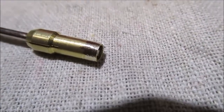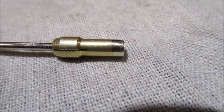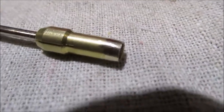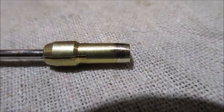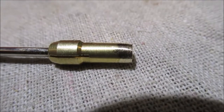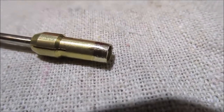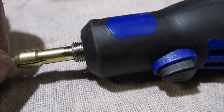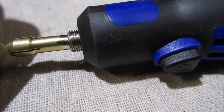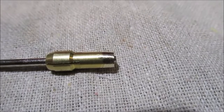Okay, can you see that taper? It's just starting going. Whenever you're going to home machine something with a grinder, just do the very end. See that? Then we got something to go by. If you get this end to just start to fit right, stop. Don't go any further. Trust me now. Then do the whole thing to that size, okay? That way you're still oversized going in the hole. Then you can sand it by hand or do something else. You could have a big old shaft that's 1 inch, whatever you need to take just a little bit off to go through a bearing or something. Just do the very tip. And when it just starts to fit in there, stop. See how it's almost too much? You're not going any further. So don't go any smaller when you grind it than what you're at already. I think you know what I mean.